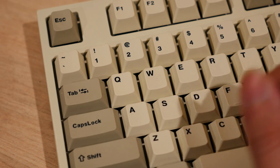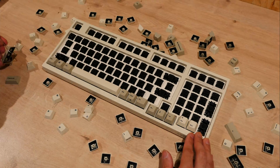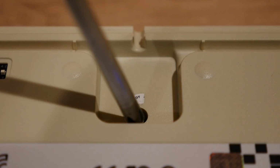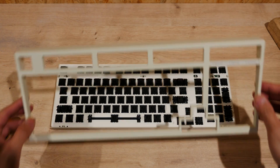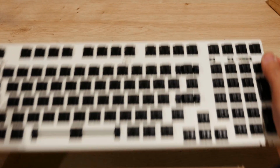Even if we were to swap springs and lube them, they're soldered on. At least the teardown is easy. Let's start with 3 screws at the bottom, 1 under this warranty sticker, then gently nudge the front and rear clips, preferably not with a metal screwdriver. We can lift up the PCB thanks to this neat connector.